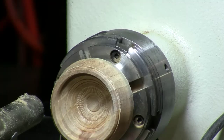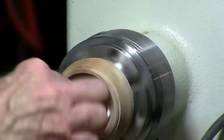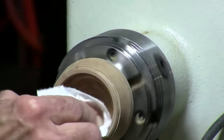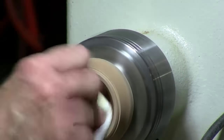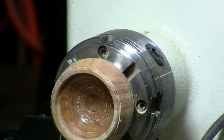I use different kinds of finishes. I'm still a work in progress, but for tonight I'm going to use the Mahoney's Walnut finish, walnut oil wax finish. It's not a real strong finish. It's mostly walnut oil with some beeswax and some carnauba wax in it. But the real socially redeeming value that it has is that it's very fast, and it gives it a very nice smell. I usually use antique oil for almost everything I do, but it takes multiple coats, and for small things, it's a little more troublesome. But for this, it just gives a very nice smell. It doesn't give it a real shiny finish. And those of y'all who sell your work, I understand that shiny sells.